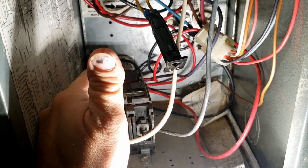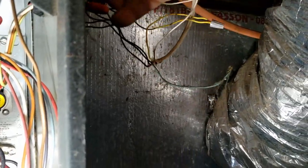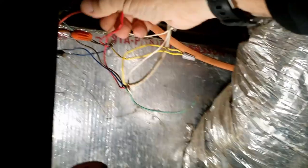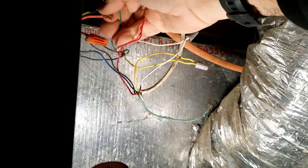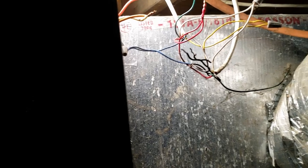In a second it should call and trip, but I went ahead and unhooked it. What we're going to do is isolate this thing from the thermostat circuit, because we've obviously got a short somewhere. Unfortunately they've got a heat pump hooked onto that, so that means extra common wires, wires running out to the outside unit — all those things can create more potential for a short. Now that we've got that, let's go ahead and hook up our jumper between R and G.